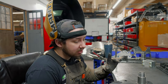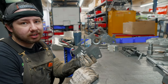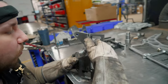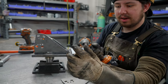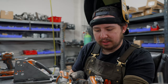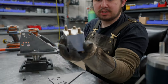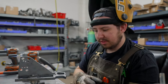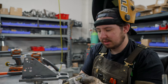The spindle is never coming apart from this knuckle face again — it is 100% one unit now. Another thing the groove really lets us do is keep the weld from bleeding over onto the edge, keeping it all uniform. We'll use the actual billet collars with some washers just to make sure we have enough play that you can slide the collar in and out without interference, and enough room to sandwich the collar down and actually lock the coilover in place.